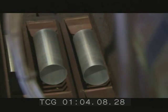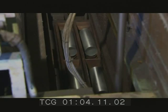the insides of the cans are painted first with an epoxy liner that's both tasteless and non-toxic. The liner is needed so the aluminum won't leach into whatever you're drinking out of the can. The protective liner bakes on inside an oven at 446 degrees.